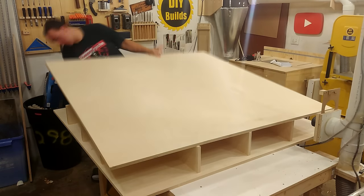Back over at the table saw, I'm going to rip down a few scrap pieces of pine. The wider piece of scrap pine is for the thickness of the air filter. The smaller piece is just an edge to keep it in place. I'm going to install this piece on the bottom, and on the top there's just going to be a piece attached to the torsion box top. This will keep the right side free and allow me to slide new filters in and out.